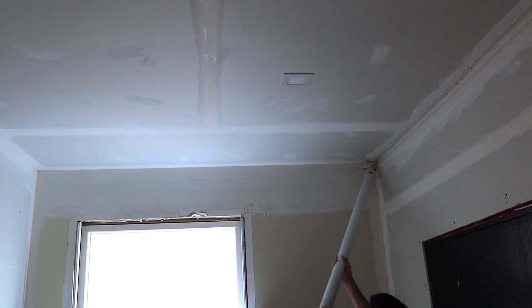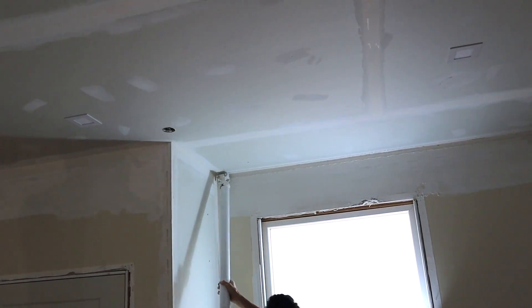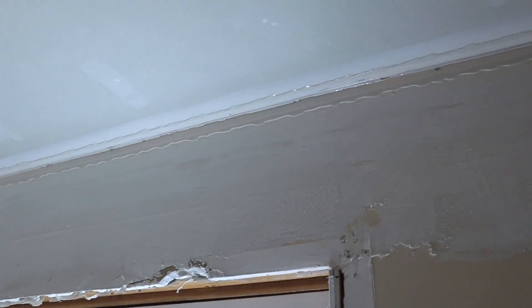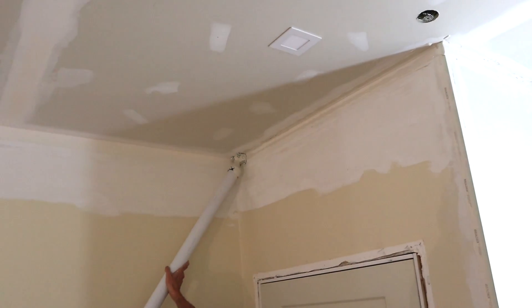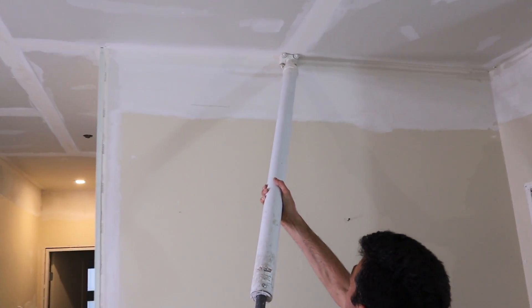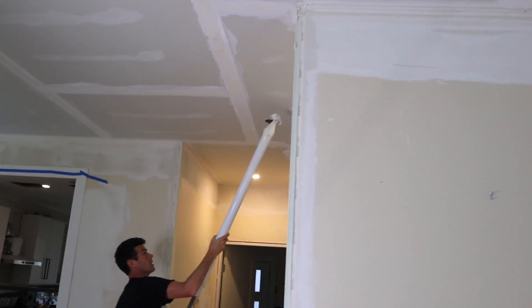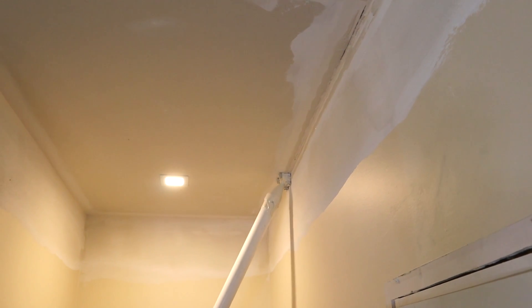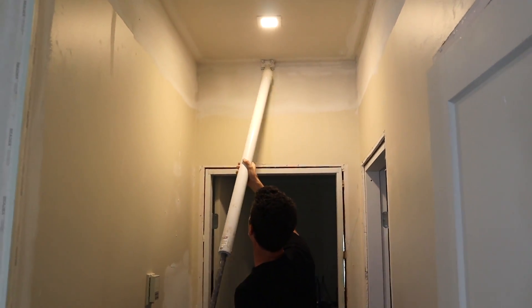These corners I can feel aren't very square, so that's going to be a challenge. That one's perfect — finally got it just right. This one upright right here — way too much on that, that's going to be a massive mess. Let's see if I can get one looking right. Whenever I haven't done this for a while, it always takes me a bit to get the feel for it. On a job like this, by the time I get the feel for it I'm already done the corners — after already puking mud halfway down the wall.